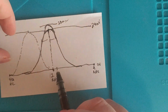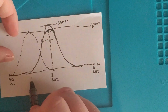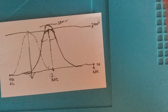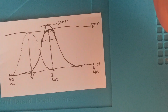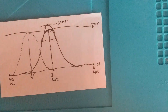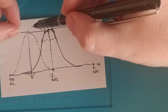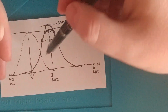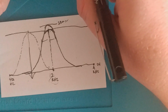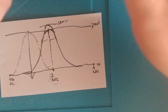As I'm doing this test, I'm actually finding out that at the max amplitude, while injecting a 1 kHz signal, it's showing up on the dial somewhere between 400 Hz and 1 kHz. So that's telling me a few things. It could be that the potentiometer may have aged. It could also tell me that there are potentially components inside, filters or a voltage control oscillator or something, that are going to result in the frequency I've selected on the dial not being accurate. So there could be some internal components other than the potentiometer itself that are an issue.